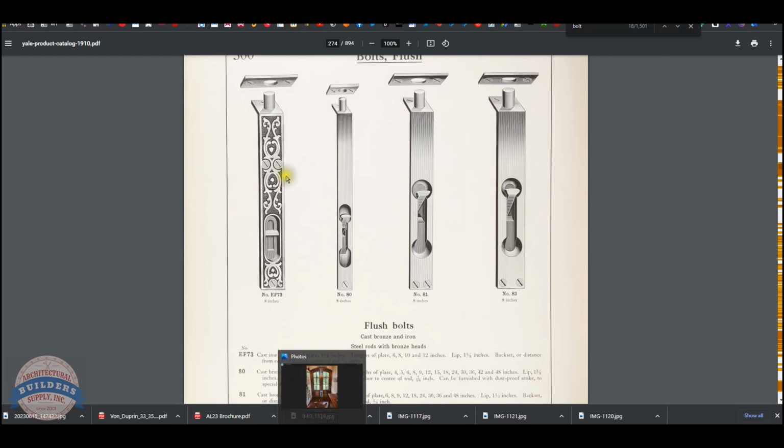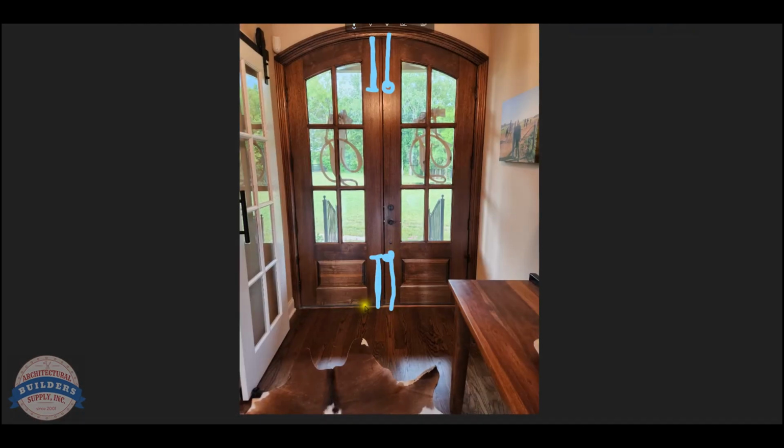And also, the reason I would is because I have the ability to bolt the active door into the same surface that the inactive door is already bolting into, for the most part. You know, your back set's going to be a little different on the face of the door than it would be mortised on the edge of the door. So that could be something worth investigating as well. So let's wrap up this video. One more component. I'm just simply going to show you the mechanism by which bolts stay up when they're supposed to stay up and not creep down when they're not supposed to.